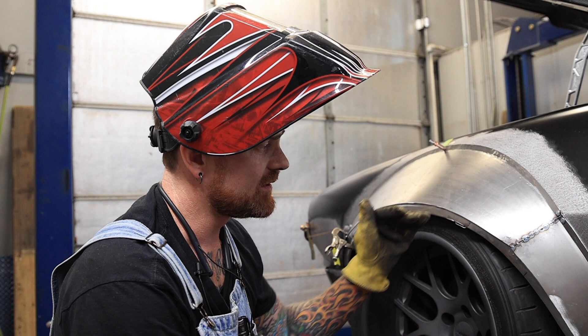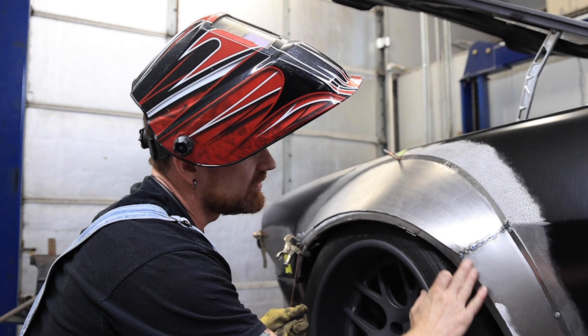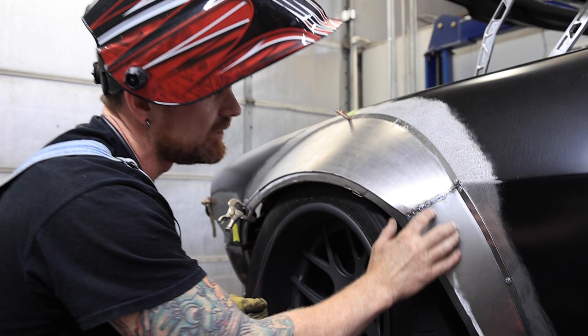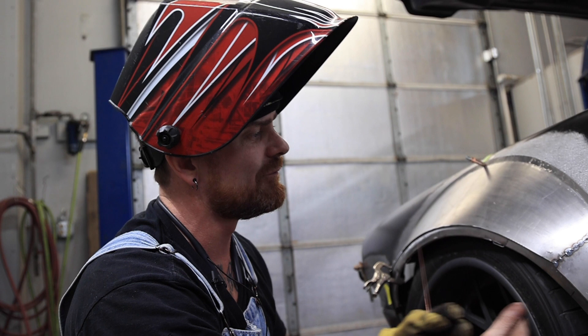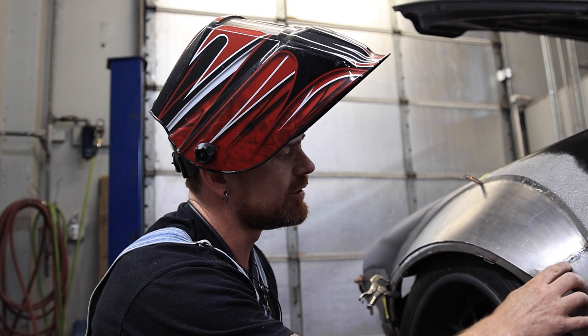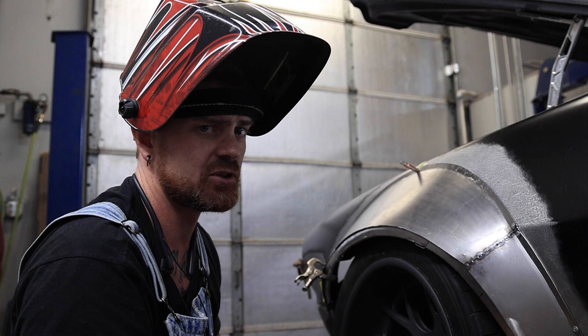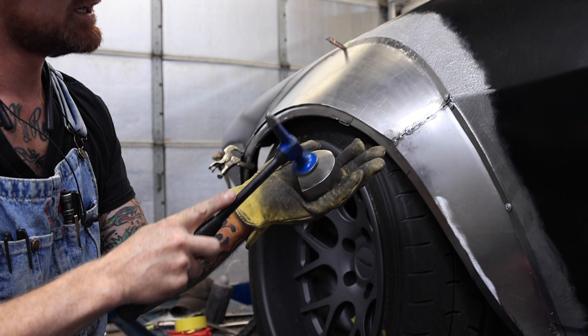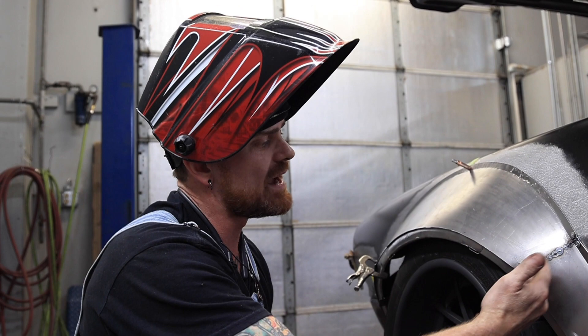We've fit the two pieces together and begun tacking — every half inch. We get the fitment nice and flush so it feels smooth as you come across it with no big step; it's 18 gauge and smooth across. Instead of welding all the way across at once, we tack every half inch, then come back and do every quarter inch, staggering in between to fill in the rest. Then we'll grind, and hammer and dolly, because welding shrinks the metal. Put the dolly behind the weld and when you get that ringing noise you're directly over the dolly — that's what gives you the stretching to bring the panel back.